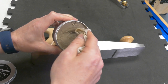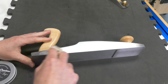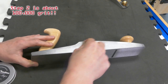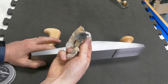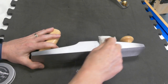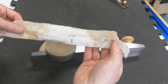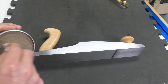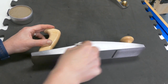This is where the Custom Grit comes in. Yes, it's usually used as a wood polish, but it has so many other uses as well. Step One is rated at about 50,000 grit and Step Two is about 100,000 grit. You can see here the Step One is taking a lot of black iron off — that's probably cleaning up residue from the sandpaper — so it's very important to remove that before moving on to Step Two. After you've applied Step Two, you'll still see it taking off a little bit of black using its microfine abrasives. Then just keep polishing with a clean rag until there's no more black stuff coming off, and you're done.